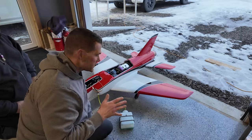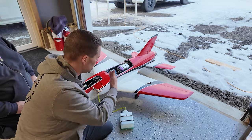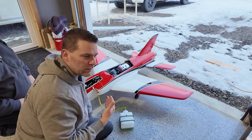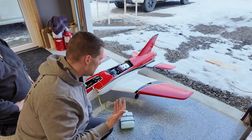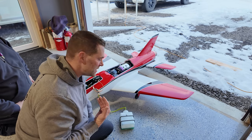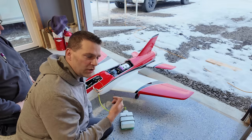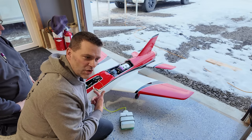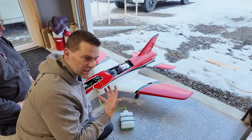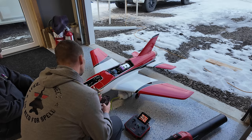Okay, so as we go through this, we're just gonna go through our normal procedure. We're gonna start it up. We've primed the fuel system to the engine. We've adjusted our fuel capacity. The engine, I'm assuming, is gonna start on the first start. We haven't run this engine yet. We're gonna let the idle stabilize. We're gonna go to max throttle. We did turn the restart function on as well, so we'll do that, and hopefully have a good test run with no crazy events.